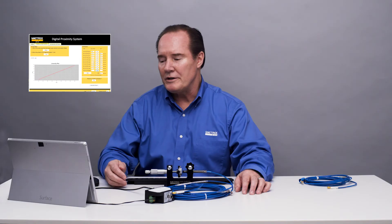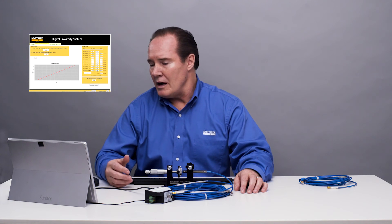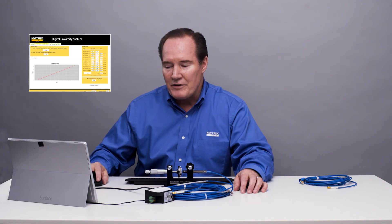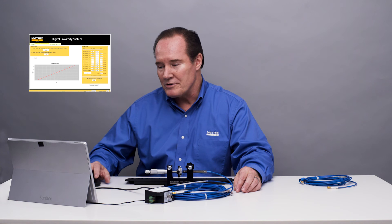This is our last point, and we'll see if it's in specification. We see that all the points are between 190 and 210 millivolts per mil, so they're within spec. We don't have to run a custom calibration. We could run a custom cal and we might be able to improve it — get those points close to the boundary right on 200 millivolts per mil — but we really don't have to. This is actually very straight, and you can see that in the graphical line. Nice straight slope — that's what we want. We're satisfied with it and don't need to perform a custom calibration.